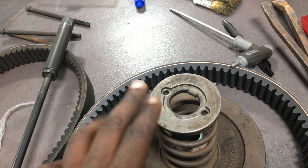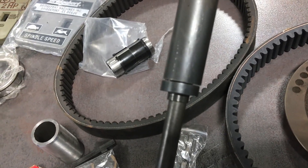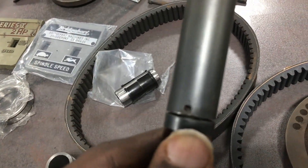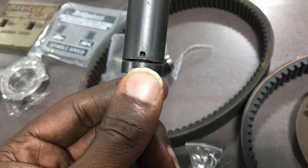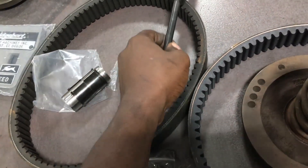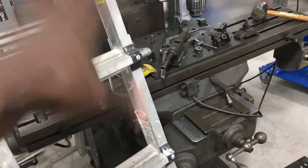Let's make this number three, because I'm going to get into this in a bit more detail. But this is the drawbar — if you're wondering what your drawbar looks like for your Bridgeport, that's what it is. Now look at the gap in here. Look straight down at it. See that protrusion? This is twisted. You see in that hole — there's a pin in there, and that pin is rightly broken. This is why ignorance is bliss. If you don't know that this is an issue, then you don't mess with it and you'll probably move on with life. It'll probably work for another couple years, but I like preventative maintenance.